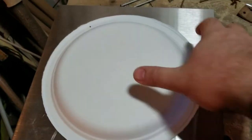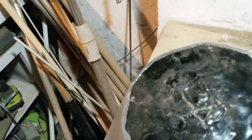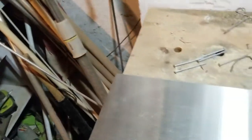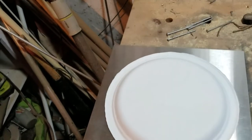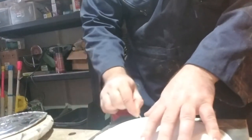I'm starting with a 12-inch square of 18-gauge stainless steel, which is a little floppy, but we're going to roll the edge. Over here I had a thinner piece of regular steel — that's a very ugly shield. Anyway, I've already rolled the edge on a test piece and it's got a lot more strength. So I grabbed a Sharpie to circle my pattern, and then I'll start cutting. I might be able to cut it with my jigsaw, which would be faster, but if that doesn't work we'll grab the angle grinder with the cutoff wheel.